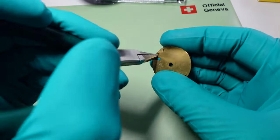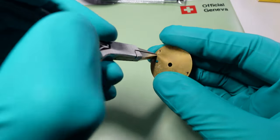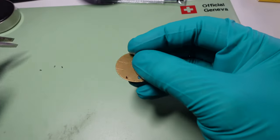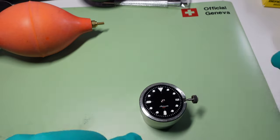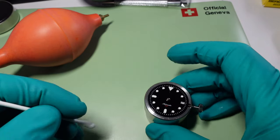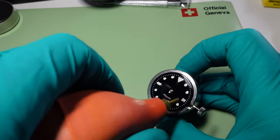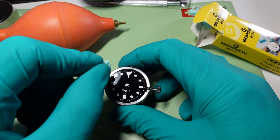I like these flat nose pliers. Normally you don't leave much behind, so you don't need to file down. But if you do take the pins off and there's a raised edge, it's worth filing it down — otherwise you can run into clearance issues and the dial will sit a little bit proud. Now it's all about cleaning, trying to get any dust and dirt off. I use cotton buds very gently to not leave residue, then the air blower, and for stubborn dirt, nothing beats a little bit of Bergeon Rodico.